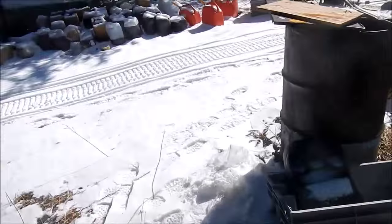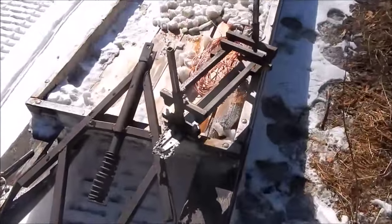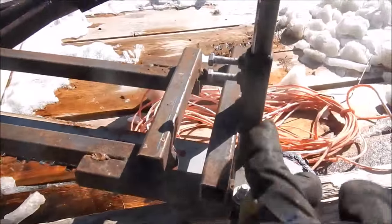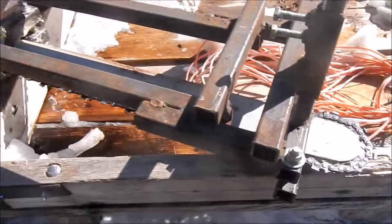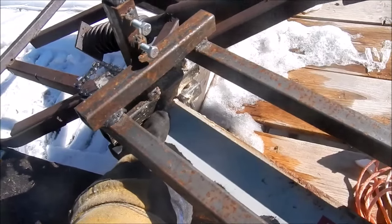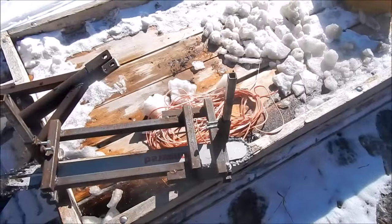Here's my little contraption that I made. It's got about a 24-inch bar and depth setters there for how thick a plank you want to make. When I first made it I only had it made up for a 16-inch bar, but when I started using it, it twisted on me because I only had it clamped there, and those bolts hit the chain — it wasn't too pretty. So I bought a 24-inch bar and extended it; works alright now.